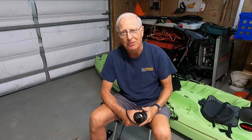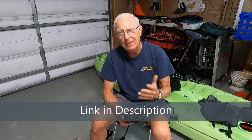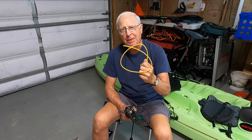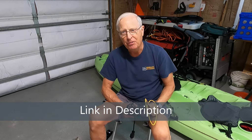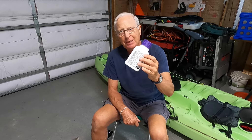The best way to do this is to get the equipment designed for plastic welding. This is a Hobie welder — it costs around $70 — but you can get cheaper versions that won't last as long at Harbor Freight for around $20. In addition, manufacturers will sell HDPE that matches the color of your boat, but you can buy bulk HDPE on Amazon much cheaper than color-matching stuff from your manufacturer.